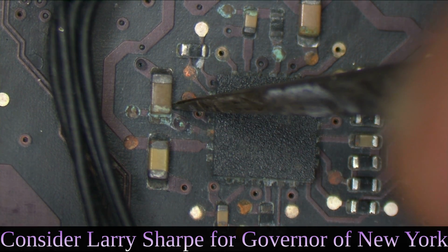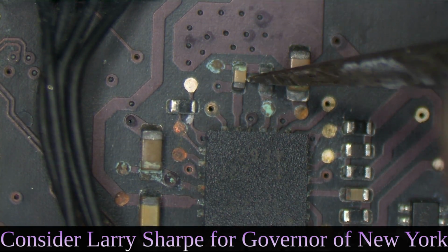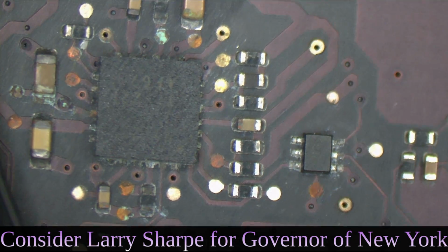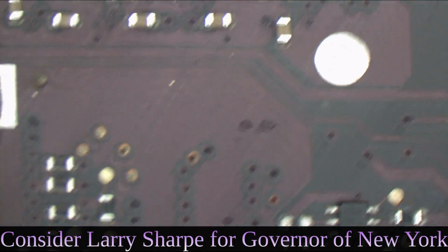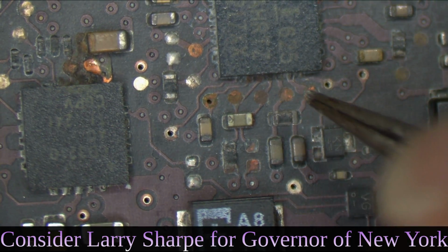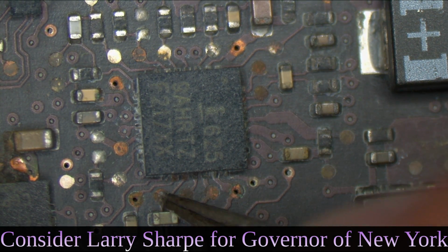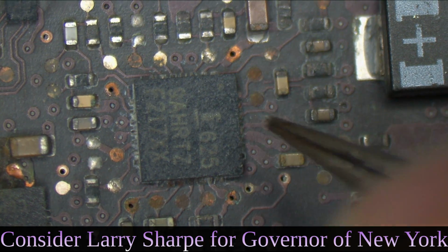Somewhat destroyed via. Capacitor that's probably not soldered on anymore. Probably. Yeah, not soldered. Probably not resisting. Destroyed capacitor. ISL6259 for creating PP bus G3 hot. Ruined probe point, semi-ruined probe point, ruined probe point, ruined probe point, and via, ruined probe point and via.